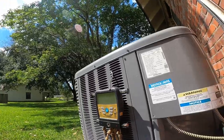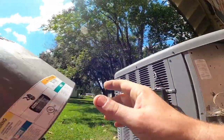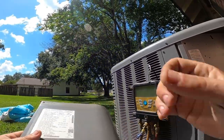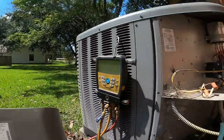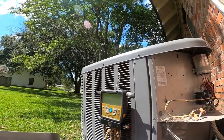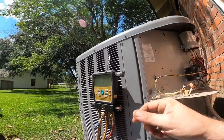Nope, no wasp. This is when they first came out with the new platform, 2016. And the reason I know that is because they got the capacitor mounted upside down - they don't do that anymore. They put them upright, which I'm probably going to do as well.